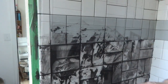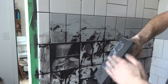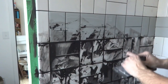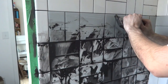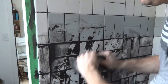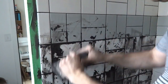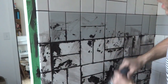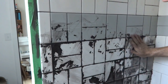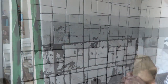I let it flash over for just a little bit. Now I'm just going to take the edge of my float — cleaned off — and scrape off a big chunk of it. It'll crumble off like this. I'm doing a 45-degree cross pattern. It's a lot easier to wipe down with a sponge later when you've already scraped it rather than leaving a real mess.